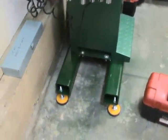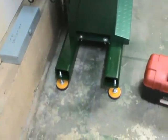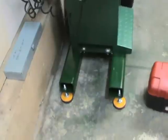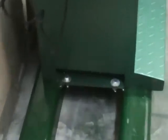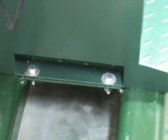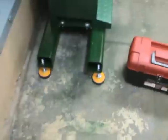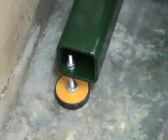When the machine was expected to be delivered I prefabbed a base for it. The base is four-by-four square tubing, three-eighths inch thick, and it's three feet long. I have heavy gauge angle iron that I welded up onto this base. This does two purposes: it gives it some weight and gives me a way to level the machine. I have MSC machine levelers underneath, so each one is set down and I can level the machine to the floor.